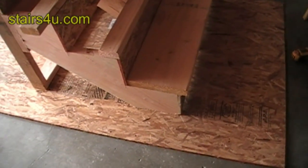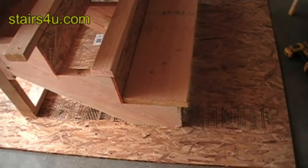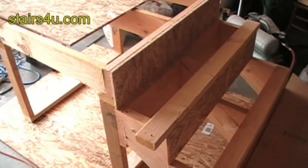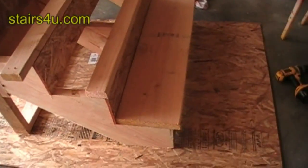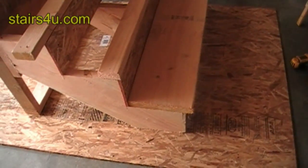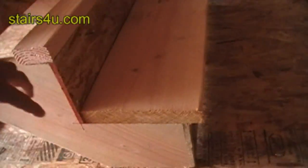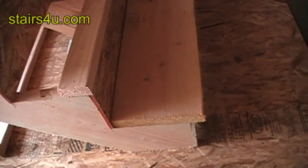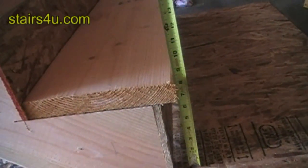Let me give you an idea of what would happen if I figured my stair tread to be a half inch — which is what I did when I cut this whole stairway as a sample for one of the books I wrote. Let's say we changed our mind: we already cut the stair stringer and deducted the right amount, but then we changed our mind on the treads. Well, you can't do that — you need to get all your planning done first.